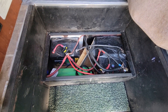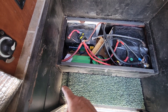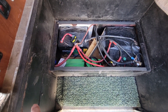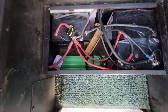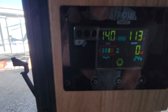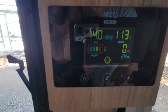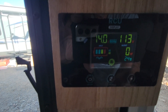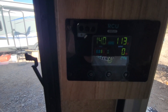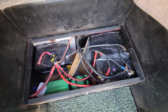There was also a cable going to an inverter underneath the passenger seat, originating from here and limited to a 75 or 50 amp fuse — this used to be a rental so it had different rules. It kept blowing that fuse, so I disconnected that cable and purchased a new 2000-watt pure sine inverter with a remote. The remote lets me turn it on and off without opening the cover, unlike the previous one where I had to bend down under the seat.